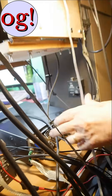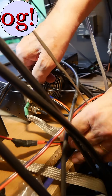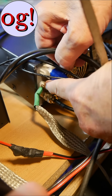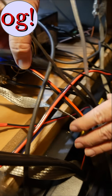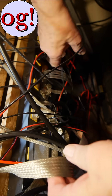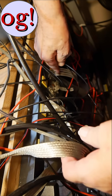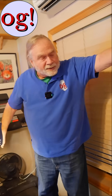I'll show you. This is the back side, and yes, it's messy because there are a lot of cables in here. Note that this ground braid comes up to this little screw — it screws in, grabs hold of that, and this braid comes down here to attach to this copper pipe right here. You can't see much of it because so many things are connected to it, and then that has a very sturdy connection via a number 2 stranded wire directly down to where the lightning arresters are.